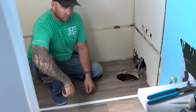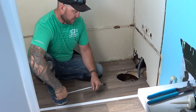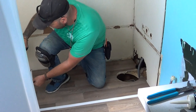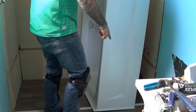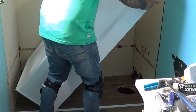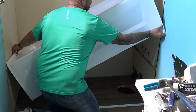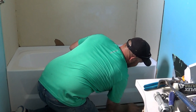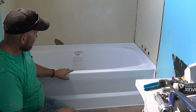Your tub should come with a track in the box or by itself. This tub is 27 by 54 by 27, so you're going to want to measure from the wall — 27 on both sides — and screw the track in place before you put in the tub. Now we're going to set the tub in. We've got our bottom track in, we've got the drain on, so we kind of push it in — these bend pretty well. We pull it down, the tub sits in there, and if we measured it right it hits the bottom track. We'll do some screwing around the edges and that'll be that.